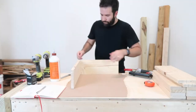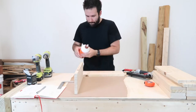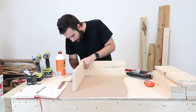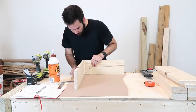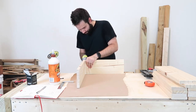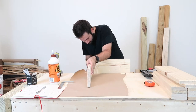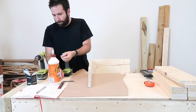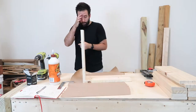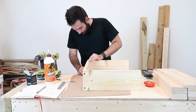When we begin to assemble, we're gonna do the main square in the middle first. The process is: apply some glue, put a brad nail in the middle to hold everything together, drill your pilot holes, and countersink every fastener. I recommend either an inch and a half or two inch screws since these are load-bearing shelves — it helps keep everything sturdy and straight. The main point is to make everything straight. You can use a speed square or any straight edge to help, and make sure as you go you always keep everything straight.